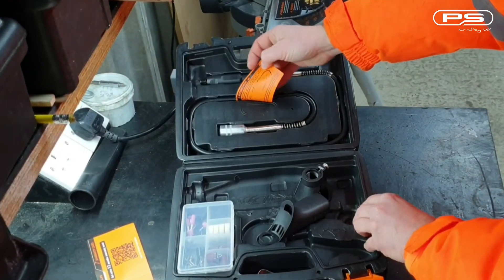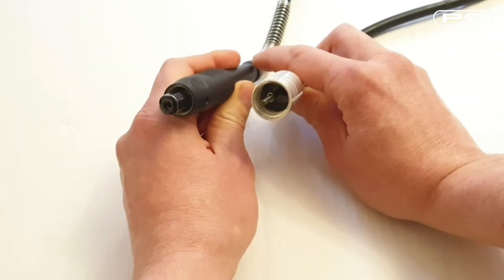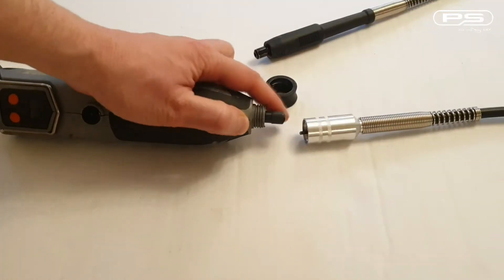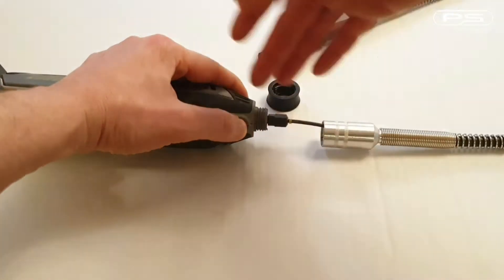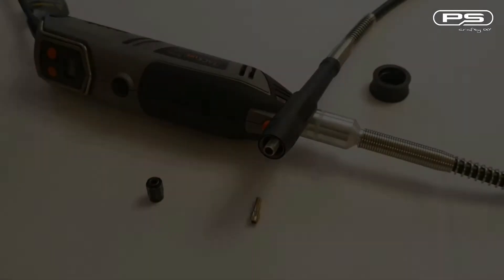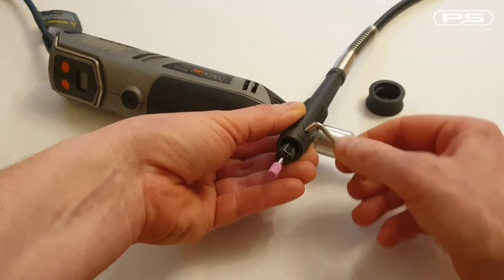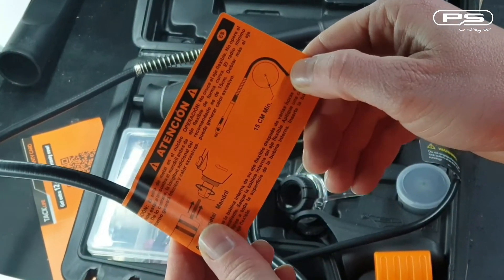Next we have the flexible shaft, neatly stored at the top part of the case. It is 110 cm long in total. Both ends are reinforced with a spring and it fits on the tool fairly easily — just remove the nose piece and loosen the chuck, pull the flexible shaft out and insert it into the chuck so that the brass ring sits flush against the chuck. Tighten in place using the provided spanner, then screw on the fitting collar onto the rotary tool and you're all set. The chuck on the flexible shaft handle is exactly the same as the one on the rotary tool itself, except it doesn't have the locking button, so to tighten it you have to use the provided hex key instead. The handle fits in hand quite comfortably and you can gain great control with it. Just bear in mind the minimum recommended bend radius for the shaft is 15 cm.